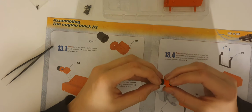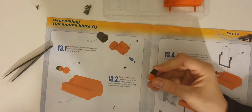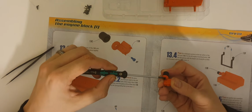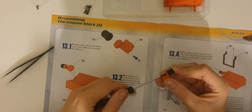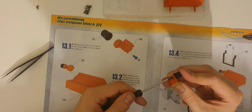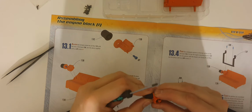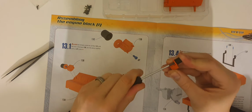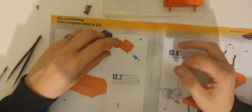Okay. So relocate that into position like so. Load up our screw. And then just line everything up. There we go. So now that's biting. Making sure, there we go. Okay, so be careful when you put the screw in because it can push the part away. So now it's saying now attach the piece you've just made to the left bank of the engine